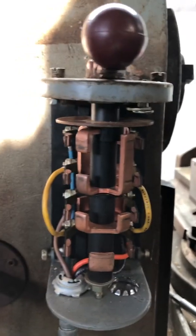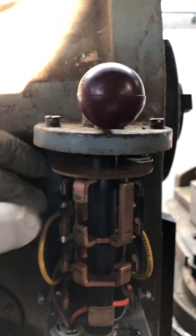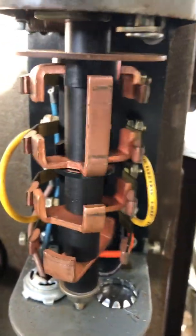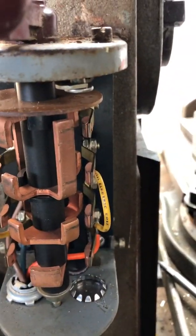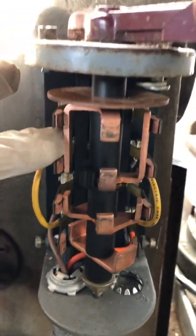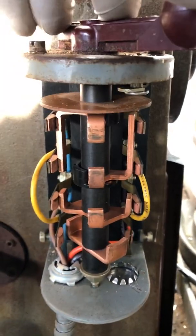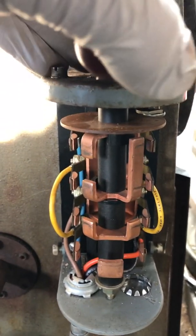The elements inside are staggered to a degree, and these little contacts are what they slide up on. Notice the contacts have a radius to them so it rolls right up and right off — this thing is meant to cycle a lot. In the neutral position, none of the outside fingers are making contact — the machine is dead. In the forward position, a big shunting bar makes contact, and its sister on the other side makes contact as well.